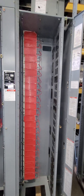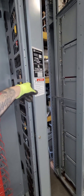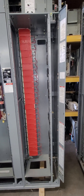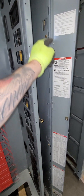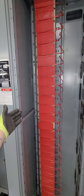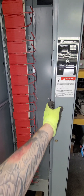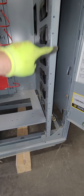Probably before you put this vertical rail in — which is what we just did — you probably should go ahead and attach your wire way door. We actually never took it off, but it's probably best to put it on now or before. It is doable at any point; you just need a ratchet or something small profile to get in and attach the hinges to this vertical rail. We've attached the 15-inch wide vertical rail, which allows the wire way door to close onto it and allows the unit substructure doors to close on to this as well. The latches for the quarter turns would be attached over here. We went ahead and installed this bracket and also secured this large bracket with a little angle bracket we left on, connected at two Phillips head screws here and two Phillips head screws at the top.